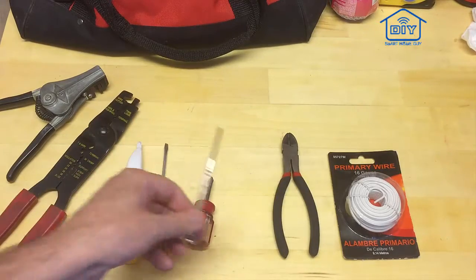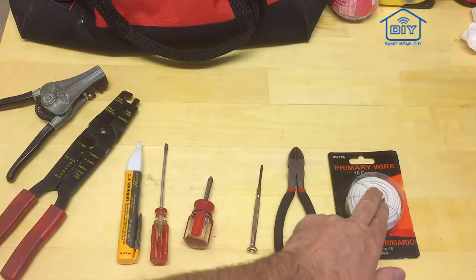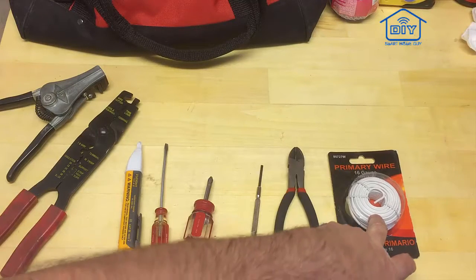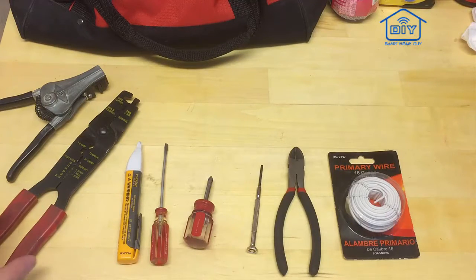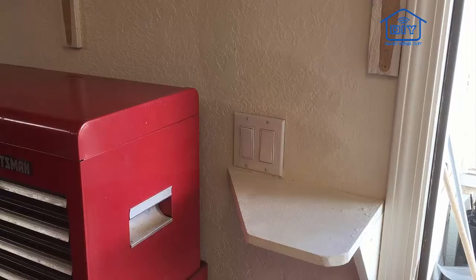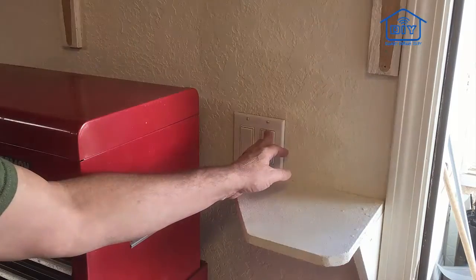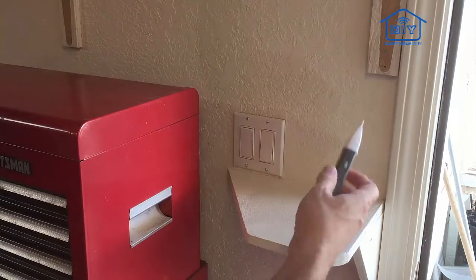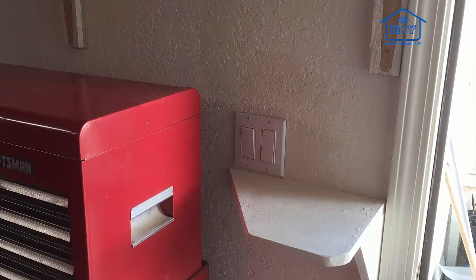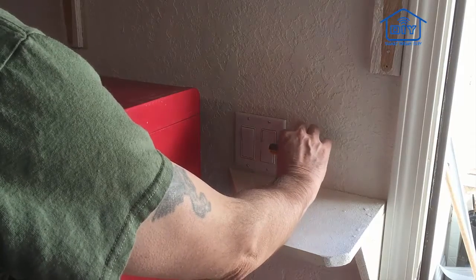You need a small jeweler screwdriver. You may need a pair of wire cutters and you may need some extra wiring — could be white and green color wiring, may or may not be needed. Wire strippers are also possible. So the switch we want to replace is this one right here — simple on and off, you can see the light coming on and off. I also like to have a voltage tester handy. So we killed power at the breaker, and again, one more time — we got nothing.